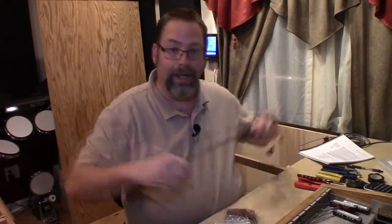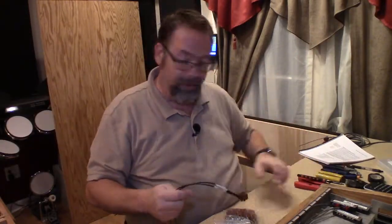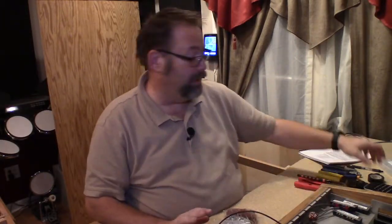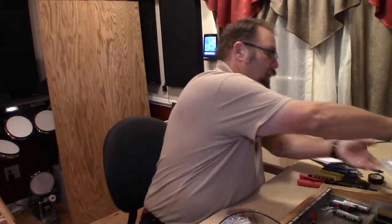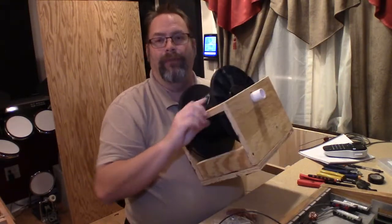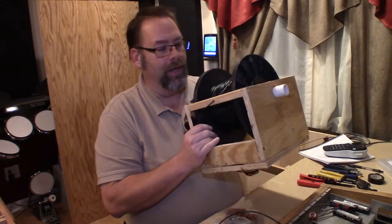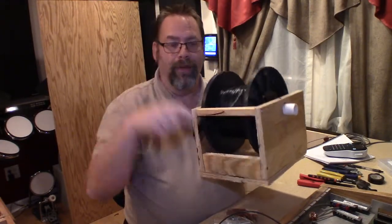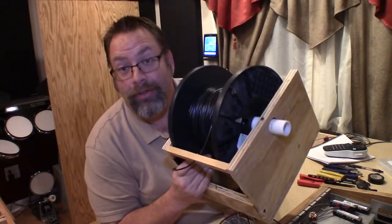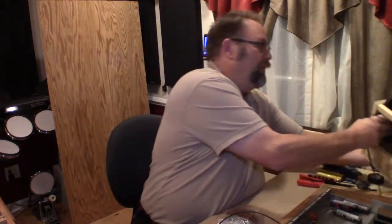This time I actually pulled the cable all the way to where it's going to go, mounted the terminal block, and started making up cables. I've got a reel of Belden Brilliance cable 8451 — just single mono instrument cable, or audio cable — so I have to run two of these for every stereo pair. My wife made the box that the reel spins on, which is pretty cool.